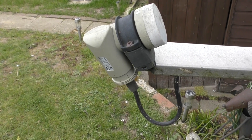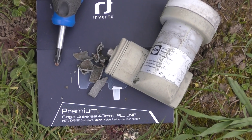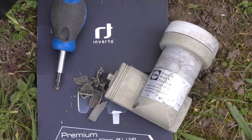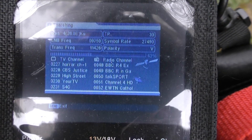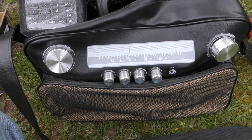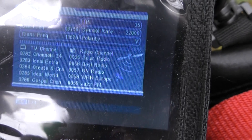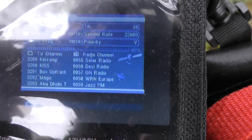Instead I've got an Inverto one and we'll see how that works. Some of the plastic on this has well and truly had it. The connector cover has broken to a million pieces and the LNB didn't feel too good, but I reckon this has been out here for about eight years — it just shows what ultraviolet does to plastic. The problem with this sized dish is it's picking up from Astra, so this is not ideal. The battery in my portable satellite meter is flat so I'm having to run it off a 12-volt power pack. I'll just let this hopefully find something on the satellite I'm pointed at, and then we'll adjust the LNB. It's always interesting adjusting this — I find better adjustment with the polarisation, sliding it back and forth for the focal point. Anyway, it's in and it'll do.